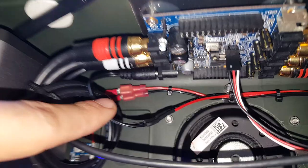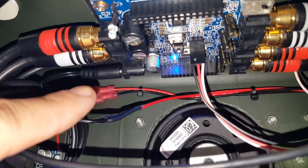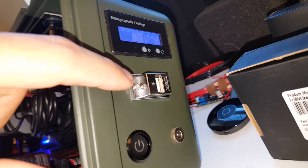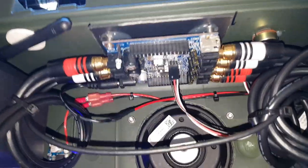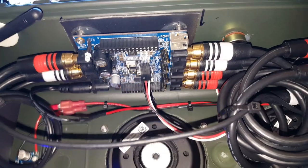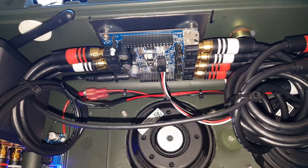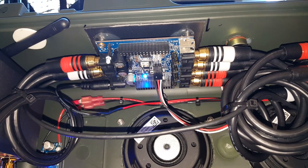Single source of power coming in — I didn't feel like soldering to the board, so I just spliced it into the 2.1mm plug. The USB connector here is not for charging; it's for the mini DSP. That passthrough feeds the USB all the way to my mini DSP 2x4. Basically I can set whatever crossover I want, dial in the frequencies for the low pass and high pass.